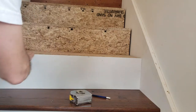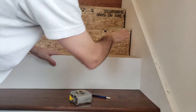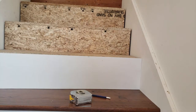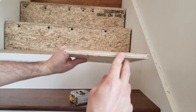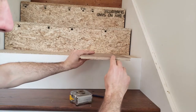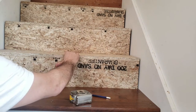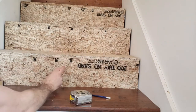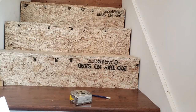The height of this, I just cut — it sits on top of the tread and then is flush with the next one. What I'm using for flooring is engineered hardwood, which is a plywood base with a veneer of wood on top. To accommodate that, I had to build these steps out of plywood. There's framing in between and a stringer in the middle, so this is all solid — everything's glued, screwed, and nailed together, so it's not going anywhere.